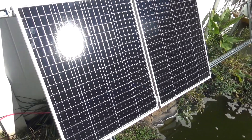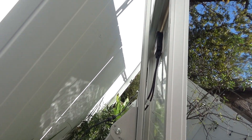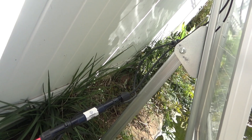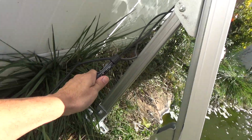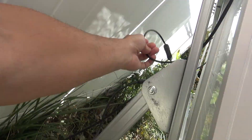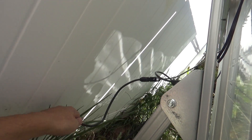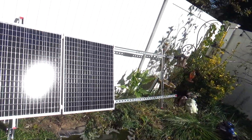Right now it's getting full sun, connected in parallel. I need to cut these plants down behind here, but I was just doing a quick connect so I got it hooked up like that. I only needed one fuse because when you hook it up in series it doesn't bring the amperage up — I just got this 10-amp fuse here. These are hooked up in a series connection. I got the positive to the negative over here, and then the negative cable here, and positive here — that's how it's hooked up in a series connection.